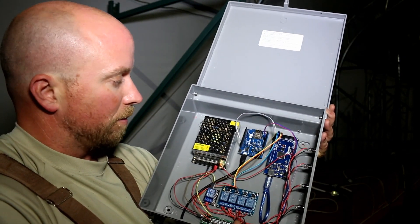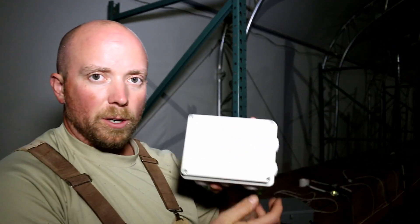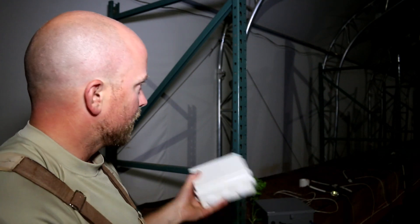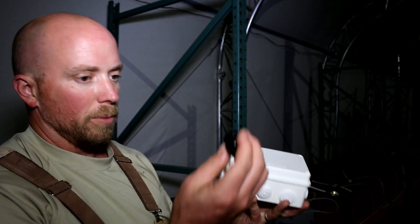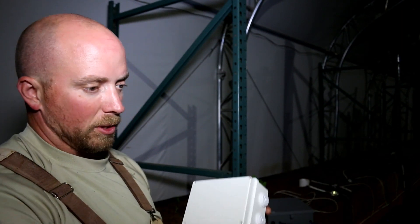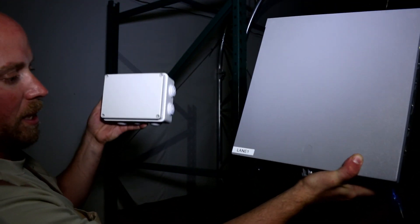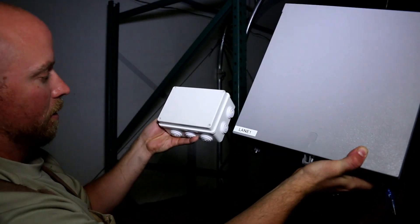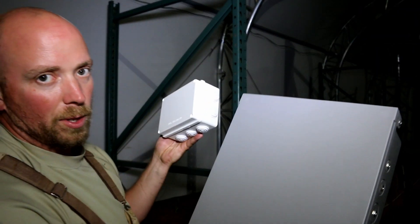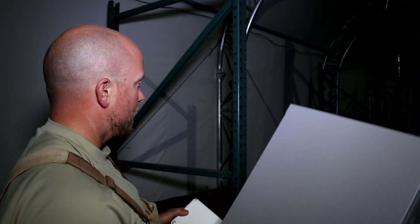This whole box is going to be everything 12 volt and under. This is going to be the 120 volt bus - there's not going to be too many things. For this lane there's only going to be five relays and they'll fit in here. We just have to run relay control and 120 volt power to these things. We've got our wire clamps here - run 120 volt in tonight and then run 120 volt out. The only thing we need to do here tonight is mount this up, connect them with 120 power, and then start working on the valves.